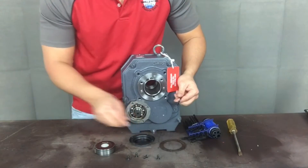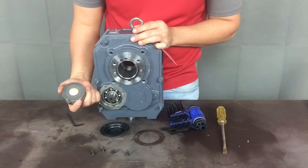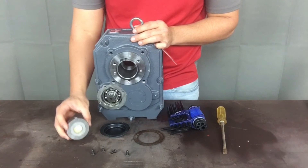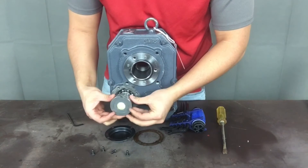After the backstop installation, we will demonstrate how to change the free spin direction of the shaft mount reducer by proper removal of the backstop and then by rotating the backstop 180 degrees for reinsertion. That step will change the free spin direction of the shaft mount reducer.